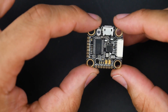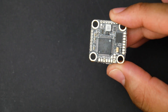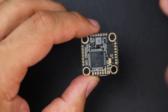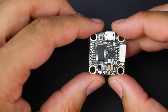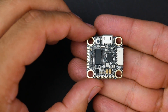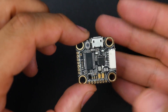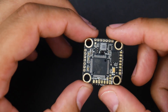We have OSD and the MPU-6000 gyro, it's running the F722, and there is onboard memory. It doesn't have any extra voltage regulator beyond 3.3V and 5V — nothing special there. However, they have bumped up the filtration quite a bit, which is really great to see, especially on a 20x20 stack — particularly if you're going to put this on a 6S build.